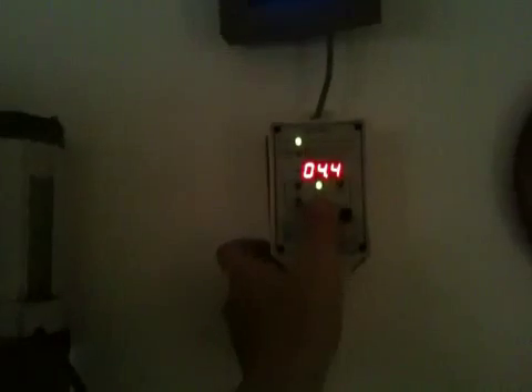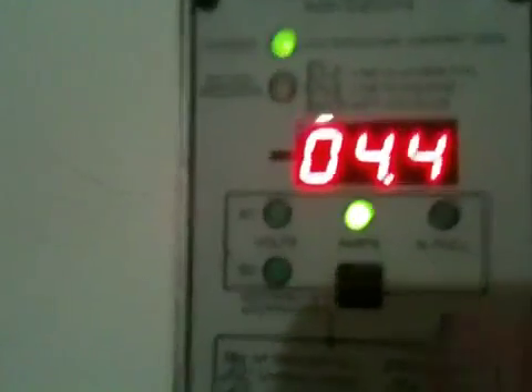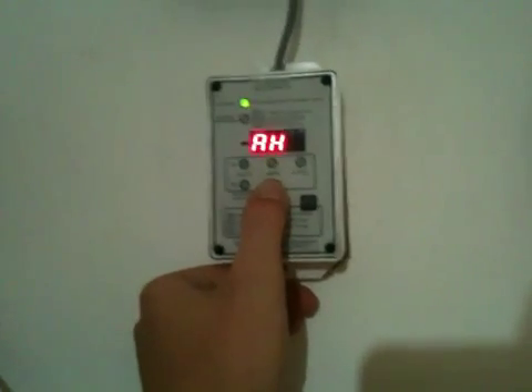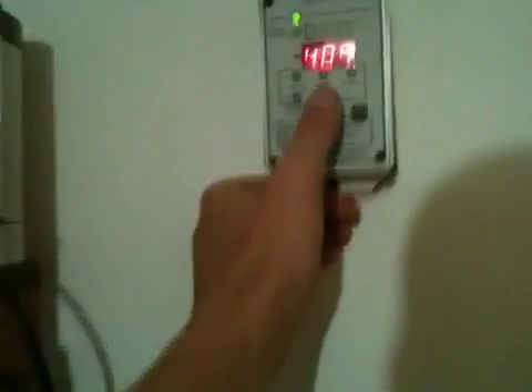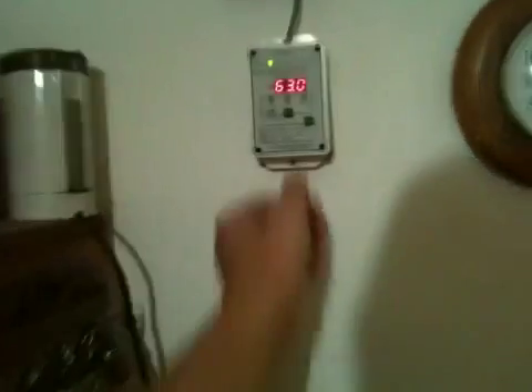You can program it to display in watts or amps. Right now it's in amps, as you can see labeled right below there. But if you'd like, you can change that to watts. If you go to your secondary settings — days since charge: 4.9 days, days since equalize is the same. I don't equalize; I have gel batteries. And my power reading is putting in 63 watts right now into the battery bank. You can have watts on the first setting and amps on the other, which is really cool. This thing is incredible.